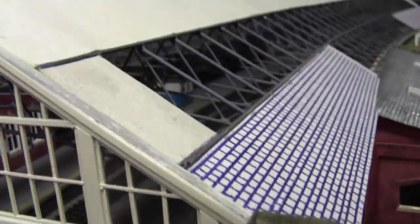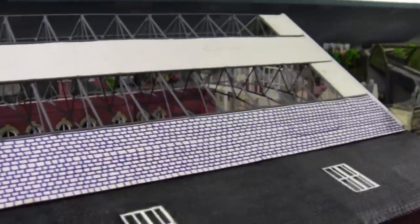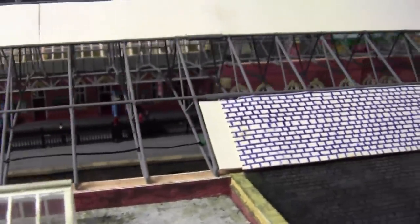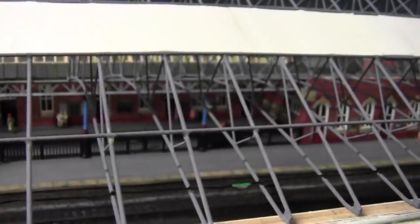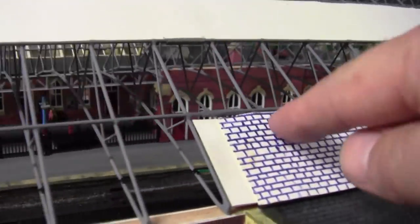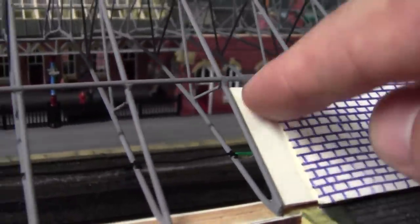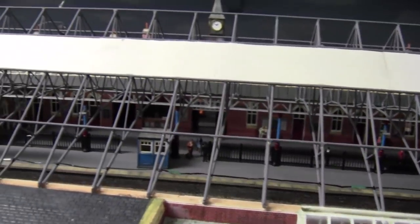This side, we've done a fair bit this week and I managed to put two tiled sections on - that's the straight bits, one piece there and one piece there. However, that middle bit with the curve is going to be a little bit tricky to do. I'm going to have to measure it point to point and try and cut the curve, then scribe the tiles on so they match exactly in line with these tiles once the card has been cut. But yeah, we've done quite well this week.